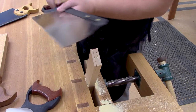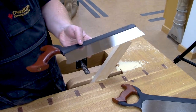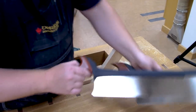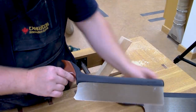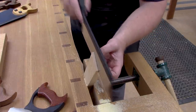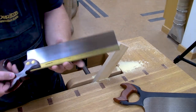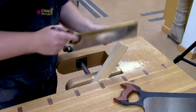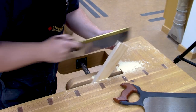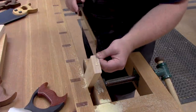You can do it, it's just going to be a little bit more frustrating. This is more of a carcass saw size — I think of this as a large dovetail saw almost, but this is a 12 TPI rip. You'll notice we don't have a lot of usable blade space between the teeth and the back. It'll cut nicely if you're used to it. This other one is a Lie-Nielsen — actually a 14 PPI crosscut — and again it's sharp, but once you get it buried in a full cut it's really slow.